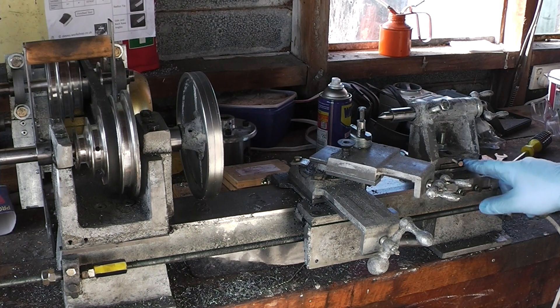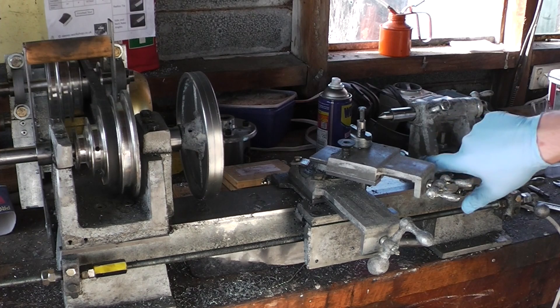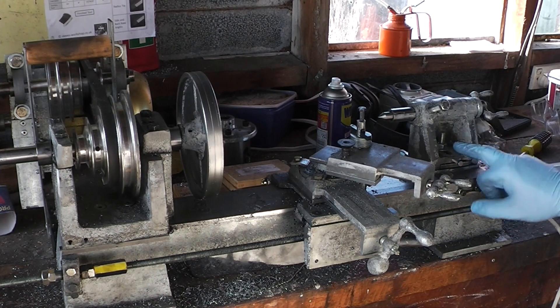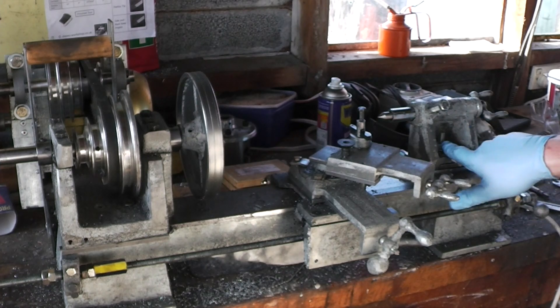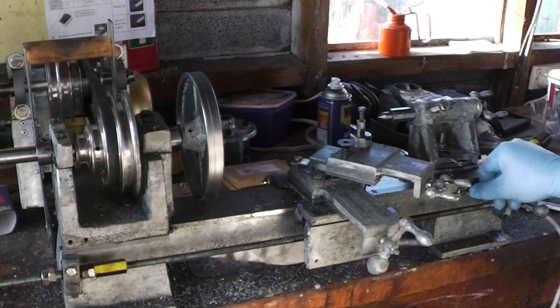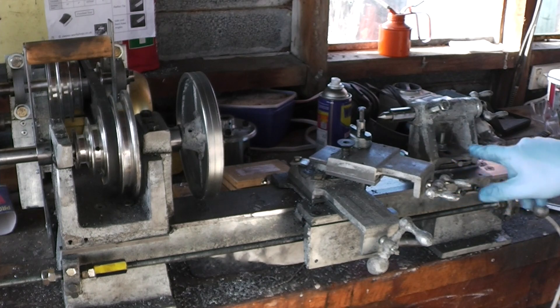For the set-over ways on top, he does give measurements and I highly recommend that you listen to those measurements so that the front face between the top and bottom is flush. For the top casting itself, using a jigsaw to cut it works pretty well — just bear in mind you're going to have to file the sides nice and flat, and after you put the engine stud through the set-over ways you'll have to file it again to make clearance for the engine stud so that the set-over ways are flush against the tailstock. I did not use a drill press for drilling the set-over way adjustment screws, and I recommend that you do, because I did not get them straight — they're centered vertically but horizontally they're skewed, which upsets my OCD.